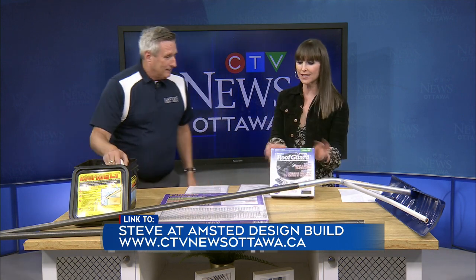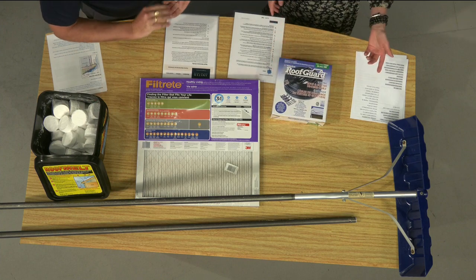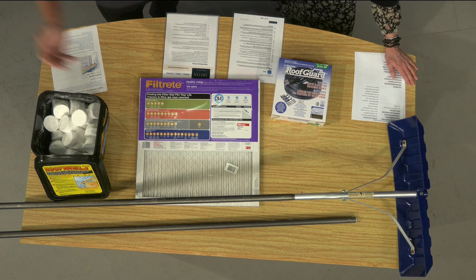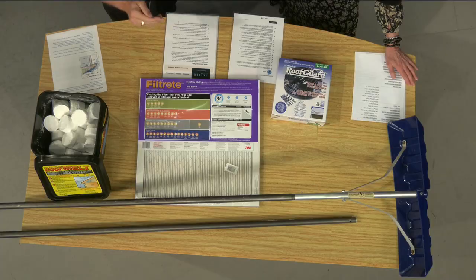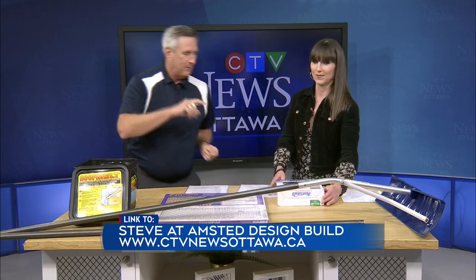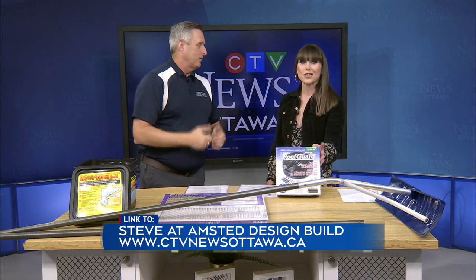And this is something that a lot of old homes, or people who own older homes, are installing, because they can't prevent that heat loss going up. The insulation values aren't there. The house wasn't designed to be insulated properly. So we have these cables that go up on the roof, and we've got a picture of that, where they just go up on the roof in a zigzag. And again, we don't have to melt the whole perimeter. We're just putting channels in the ice so that when the water comes down, it can flow off the roof and create those beautiful icicles.